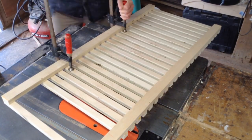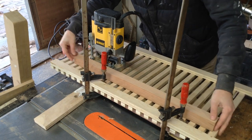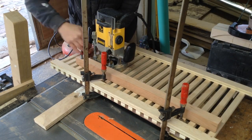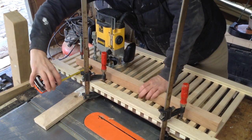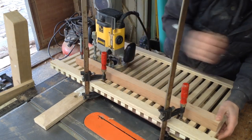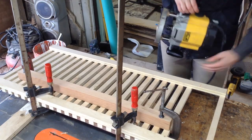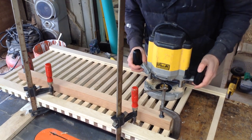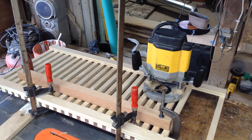For the slats, I lined them up with the bottom and top of the piece, which means all of my slats would be parallel. This is a better look at how I set up my stops — I put it in place at the depth I wanted, made sure it was the same distance on both sides, and clamped a scrap piece of wood in place. On the other side, it was really easy: it was three-quarters of an inch, so I could just put a three-quarter inch slat there and clamp that into place.